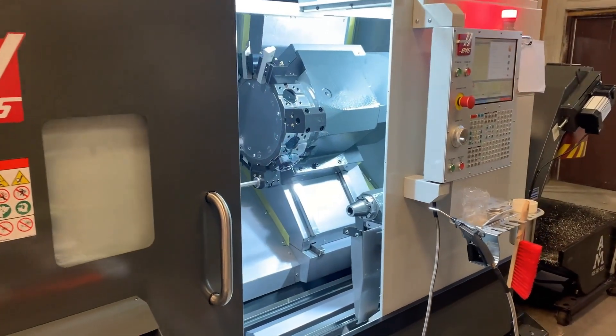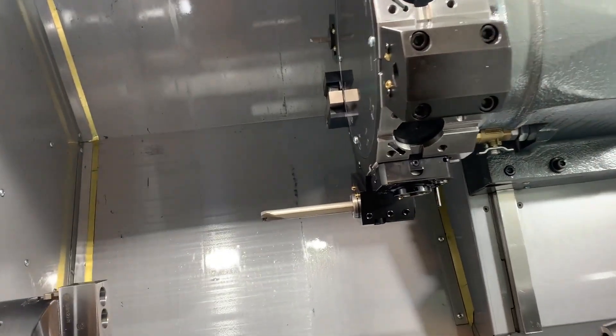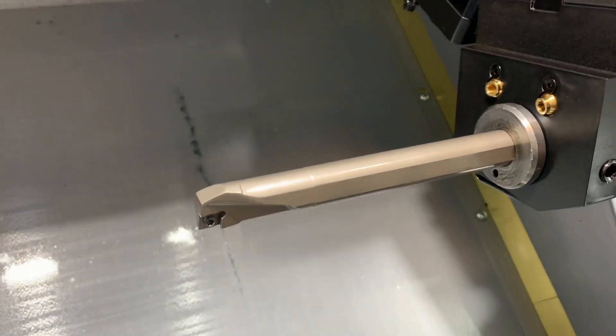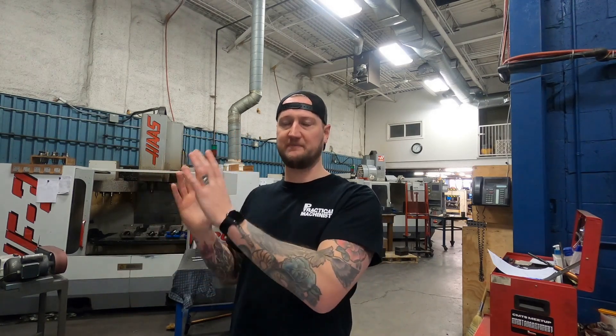Step nine: we have to fill it up with coolant and get tooling in. Unless you're a huge shop, you may not have enough tool holders and tooling on the shelf to tool up another machine, so we had to order in a new tooling package. We also had to get a new NC post for our Mastercam CAM software, so that when the software spits out our programs into NC files it knows what kind of machine it's targeting - its capabilities and how it reads code. Some people can write posts themselves, but we just had ours done by our CAM software provider. After all that, we were finally ready to start making chips.